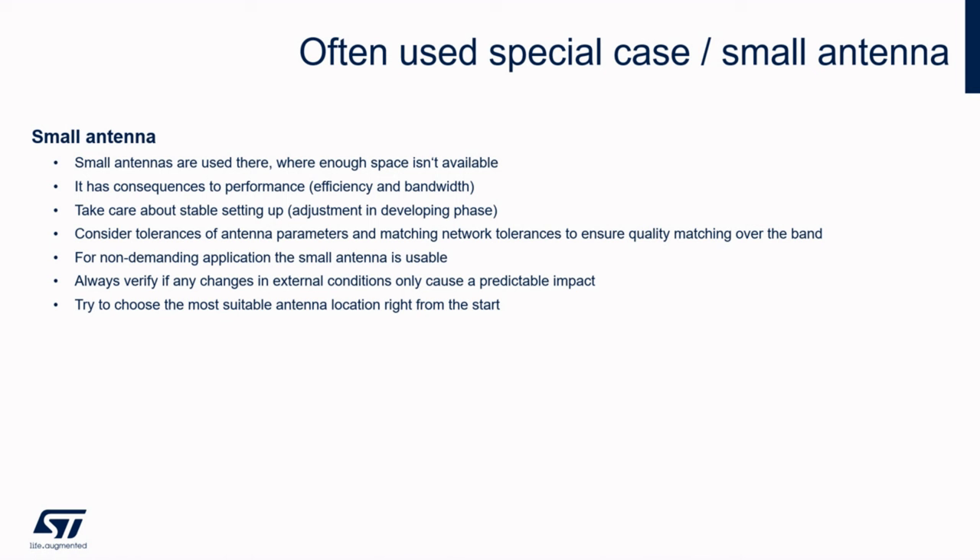Although it is stated that the small antenna has a gain, it also has certain losses in efficiency and a narrow bandwidth. The smaller the antenna is, the more you must care about accurate impedance adjustment and overall tolerances, as it can easily cause a worsening of performance. The antenna for BLE is mostly narrowband, sitting in just 100 MHz bandwidth. Efficiency is not a problem if the device communicates over a few meters, but for demanding applications it could be an issue. For a certain application a small antenna can be used, but you have to be aware of the consequences.